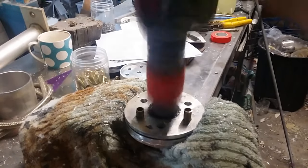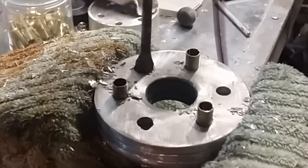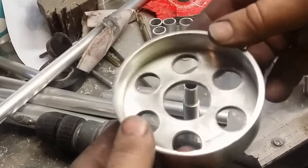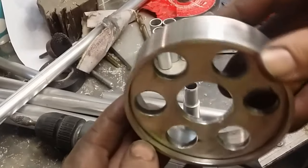And again, I've got the three pieces stacked up there again and drilling them out so that the holes maintain the same position. Just a very quick alignment test to make sure that the spacing is right. One of the things I'm doing is a little bit different in that I'm actually making these parts up and press fitting them. So you'll notice that there's no welds in here or any joinery of any kind,